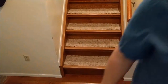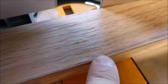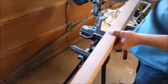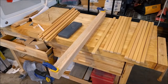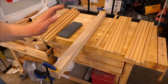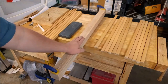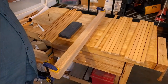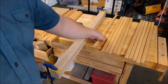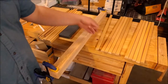Measuring the staircase I realize it's three feet across and pretty consistent. I have some old oak that is one by two that I'm marking to be 34 inches and then cutting. These will be the top and the bottom of the baby gate, so I'm making sure that they're consistent. With it being 34 inches long and the slats spaced every three inches according to the original crib, that makes it so I need 11 of these. Spacing every three inches won't come out even, but you actually don't want it to, because you want one really close to the edge for the hinge and one out a bit for the hook.